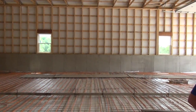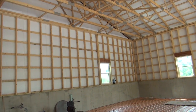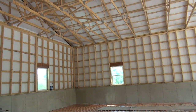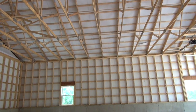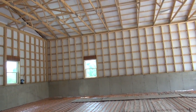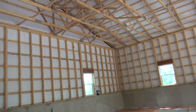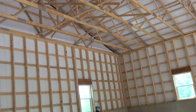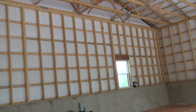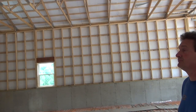In his garage, it looks like what they think is solar guard — he's got an R7 value. He will also have a steel ceiling in here, with R38 above the steel. So he's going to insulate up there, and that's what the heat loss calculations assumed. He's also going to have six inches of insulation in the walls. So this will be a relatively efficient, tight building.